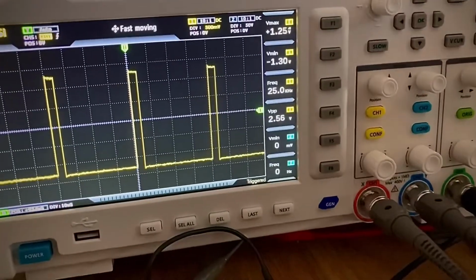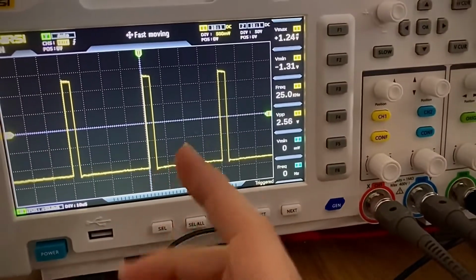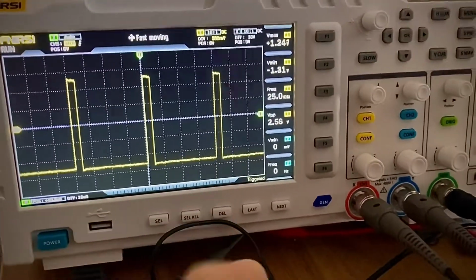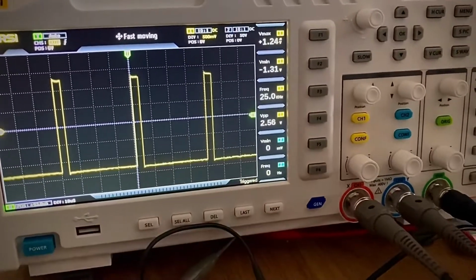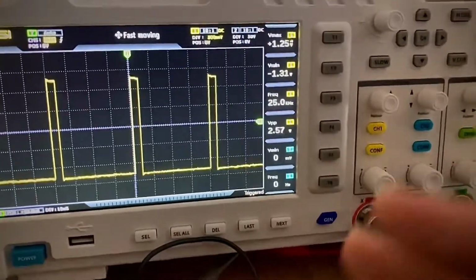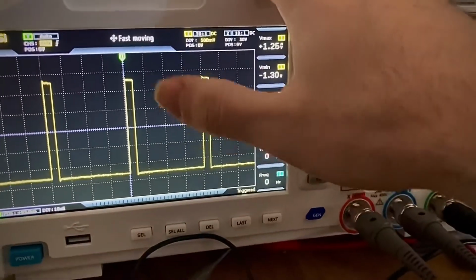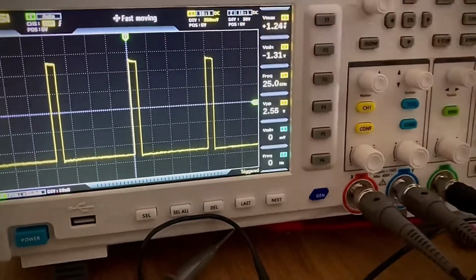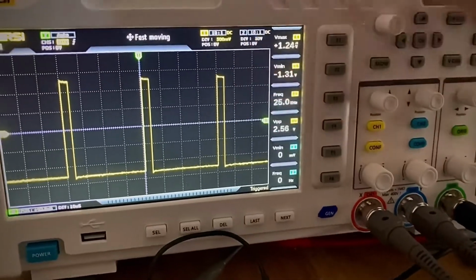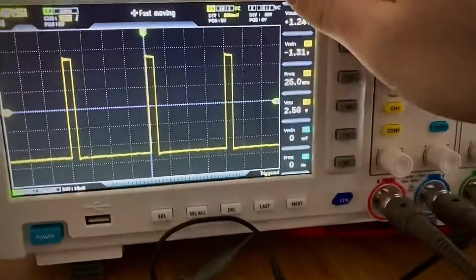But then let's say that I want to record that signal. You can record any signal, right? Whatever you can get from your probe, you can record in this one. So I'm recording this because I'm lazy enough to not create a proper, cool signal to record. The 10% duty. Let's say that this is the output of an Arduino or whatever. I could just record it, and instead of running the Arduino, I can just run this and test the other parts of my circuit instead of using a real Arduino, or Raspberry Pi, or even real crystals like I'm trying to do here.